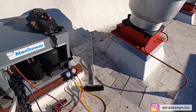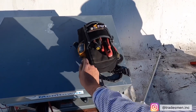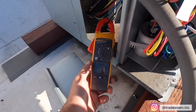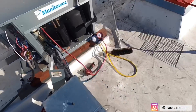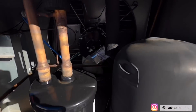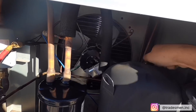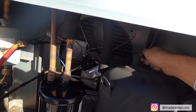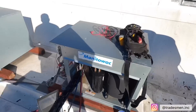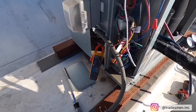So for some reason I'm getting zero amps. Pressures are going off the roof and the condenser is still not running. So right now I shut off on high head. I have to look at that fan cycle control and go from there.